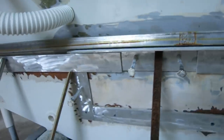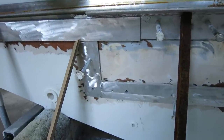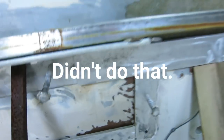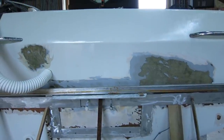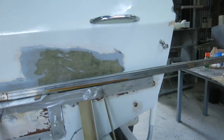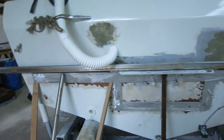After messing with it for a while I realized I could have done a better job on the workbench. All I'm going to do right now is put a medium weld here and here, then take it off, put it on the workbench, and straighten it both ways — make sure it's flat against the transom. I'll use a straight edge to make sure the two additional wings are parallel and not going up or down.